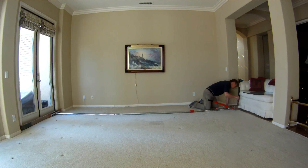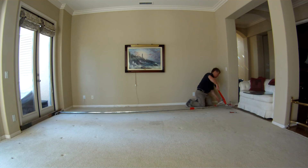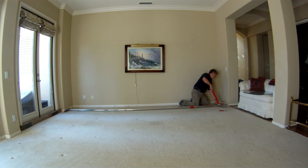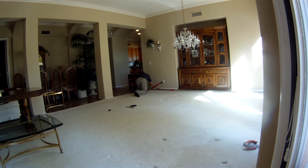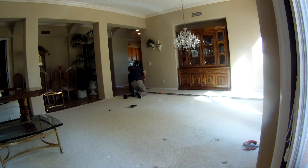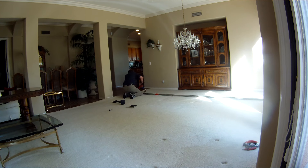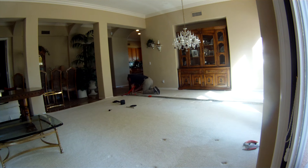Or the carpet was not properly installed in the first place, which is the most common reason for carpet buckles to occur. With the big box stores driving down the price of flooring and offering free carpet installation, there's just no money to be made for the average installer. They have to make their money in volume by doing multiple installations per day, which means they don't have the time to use a power stretcher to properly install the carpet. They kick it into place with a knee kicker and move on to the next job, leaving the loose carpet to become someone else's problem down the road.